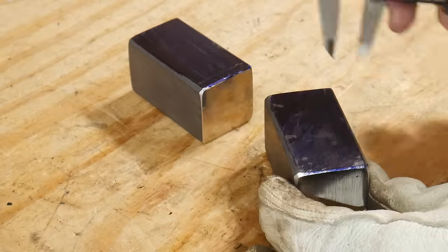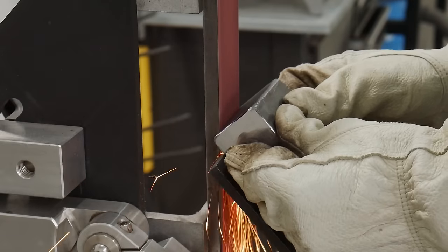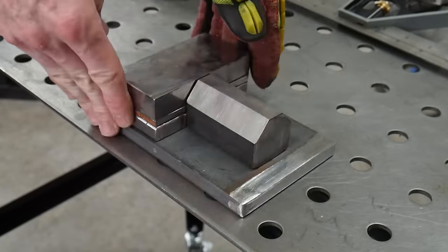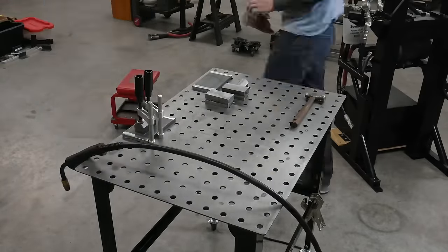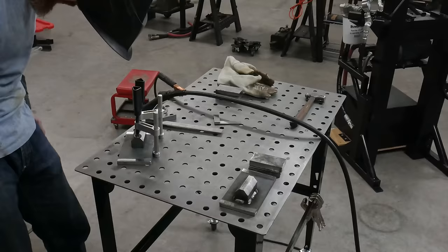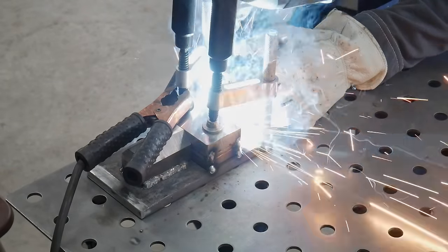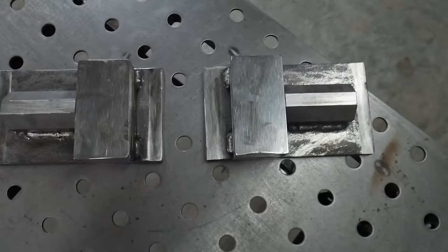The front holders that keep dies from shooting out will be added at the end of the build. Here I'm making a set of combo dies with a drawing section and a flattening section. The drawing section uses a piece of half-by-one-and-a-half bar and the flattening section uses leftover plate steel from the original dies. After talking with guys on the forums I'll round over the sharp corners on the drawing section to prevent deep gashes in billets.